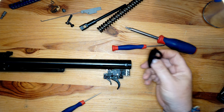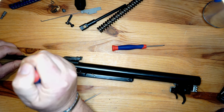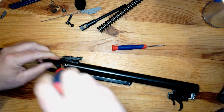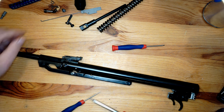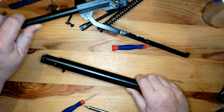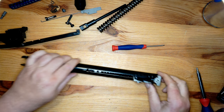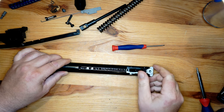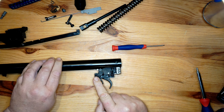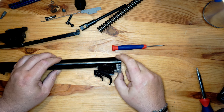This can slide all the way out and you can just unhook that from the barrel. That piece just comes out the end — that's the barrel bolt. So you just do that and then that's your barrel off. Put that to one side. The spring is in here, there's your trigger group on this end. That is held in with a pin just in there. So what we need to do is squash this up to compress the spring so that we can get the pin out.